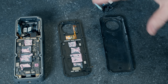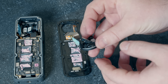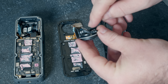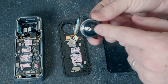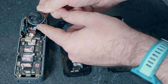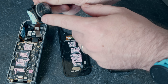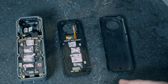There are four main components in this disassembly. There is the camera sensor and lens assembly, which is a pretty neat little thing — basically a camera sensor, a 45-degree prism, maybe some optics, and then a fisheye lens. That goes like so, mounted on the inside. The blue goop is helping spread heat off of the sensor chip, and that just hangs out in the middle.